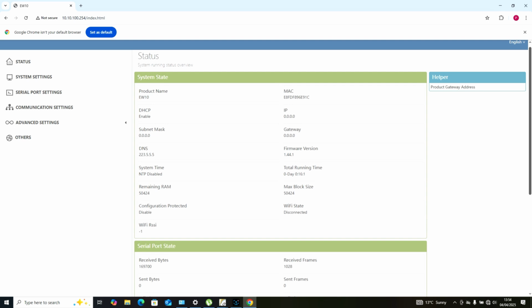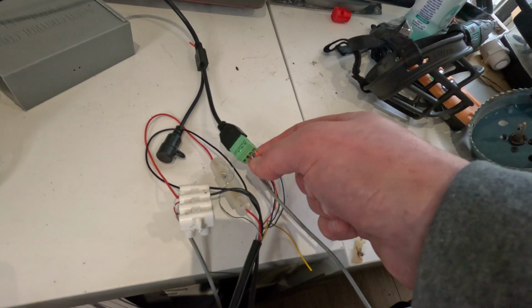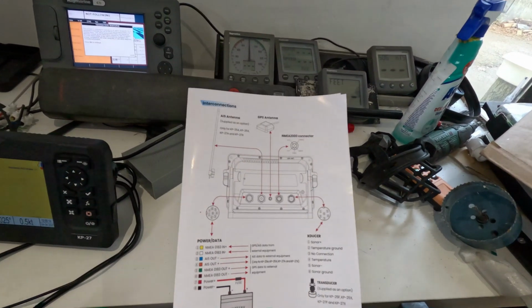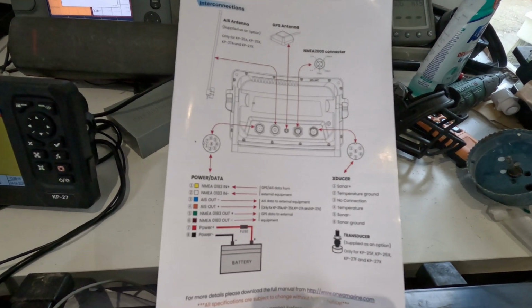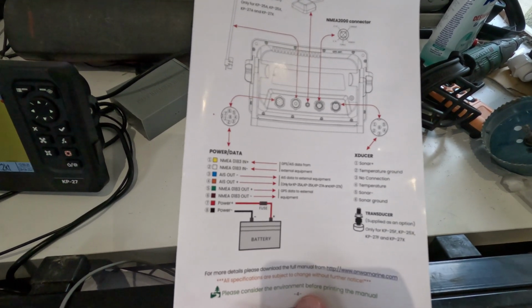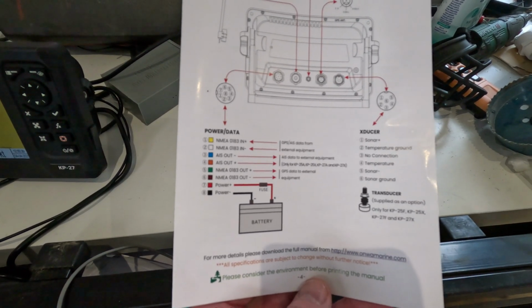What we'll do now is show a quick example of how it's all linked into OpenCPN. So basically connect this laptop over TCP/IP to the wee hardware device, which is connected to my AIS output on the Onwa. Again, you can see the wiring, orange, which is the TX. I'll show you the wiring here. The yellow ones are in, and the negatives we just all put to the same negative anyway. The blue's AIS out, and the green is NMEA 0183 out.